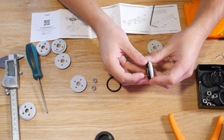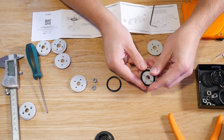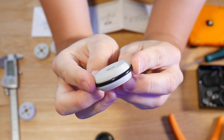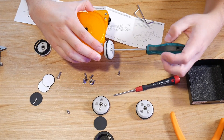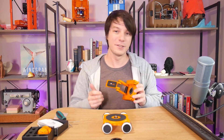Except for the wheels — those just hold the two halves together. There's actually a plastic ring underneath the O-ring which keeps the wheels fully concentric, so you don't need to worry too much about your 3D printer being out of spec. It will actually slide really well, and I'm quite happy with the movement of this.